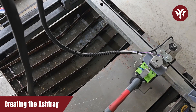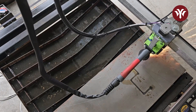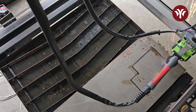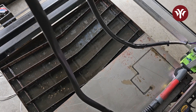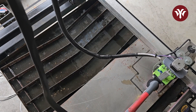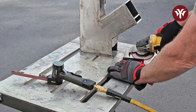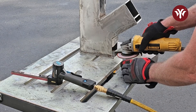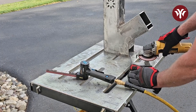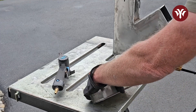For the ashtray, I cut it out of 1/8th inch steel. I used the CNC machine and the original plan file from Jim Beebler. There was quite a bit of sanding that had to be done to make sure that the ashtray would fit perfectly inside the body. Now that it fits perfectly, it's time to clean up the piece and get it ready for welding.